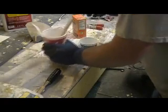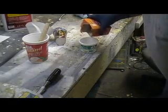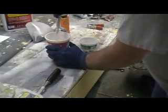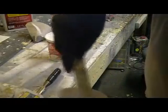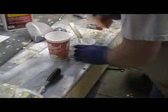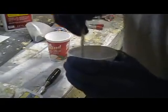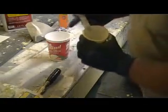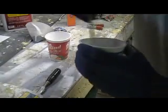I need to take a little bit of this resin and thicken it up to put in the corners, because fiberglass doesn't like to go in them corners very well. I'm going to thicken it up just using baking soda right off the shelf. You can use Calcium Carbonate or Cotton Flock, but we're really not looking for strength here — we just want a filler to get in them corners. We might as well go cheap, and plain old baking soda just works fantastic.